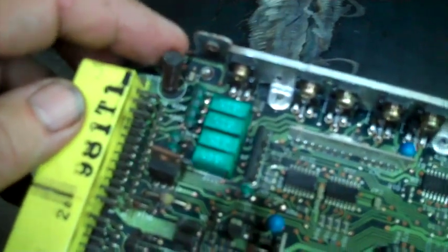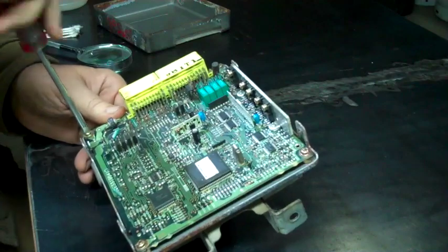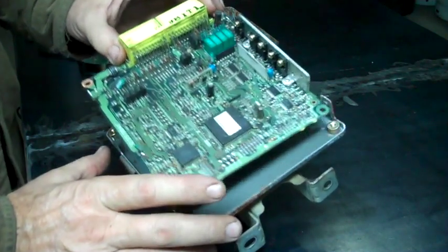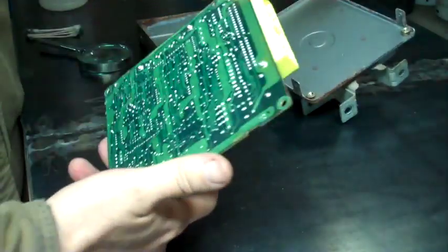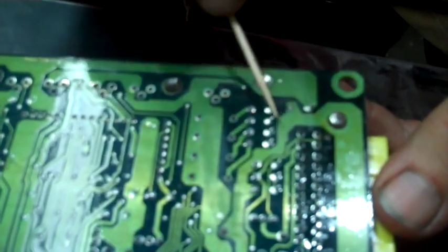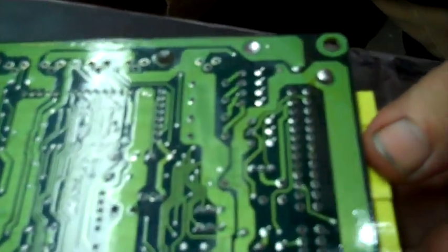This one's bad for sure, so I'm going to replace that one. I'm going to take out this circuit board now — making sure I'm always touching the steel table. It just has four screws, one in each corner. Now this should pop right out of here. This capacitor here — C103. If I look at the other side, I can see that capacitor connects this side of the circuit to this side. One leg's there, the other leg's there. It's important to pay attention to which side has the negative stripe so you don't put it in backwards.